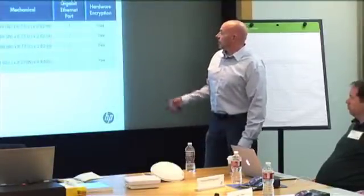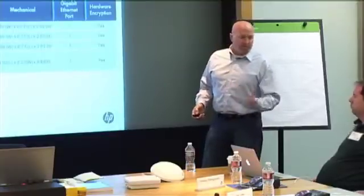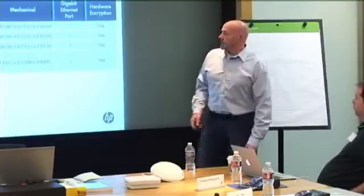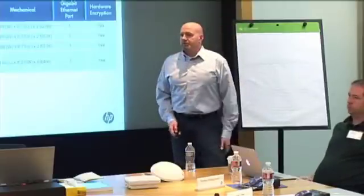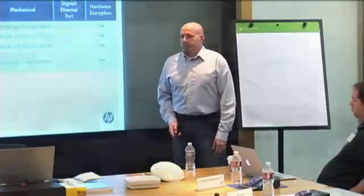One thing I do want to point out is we do have gigabit interfaces on all the products, which you have to have for 802.11n, and encryption is actually done in hardware in the product. Any plans to do multiple gig ports and do LACP or failover or anything like that? It might be a roadmap item, and I cannot comment on roadmap items right now.